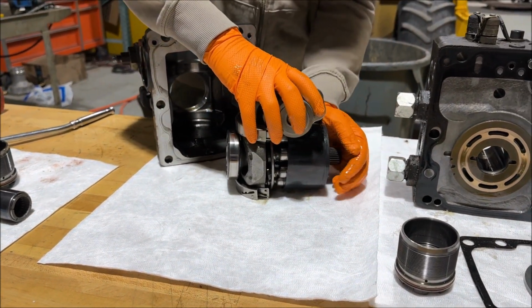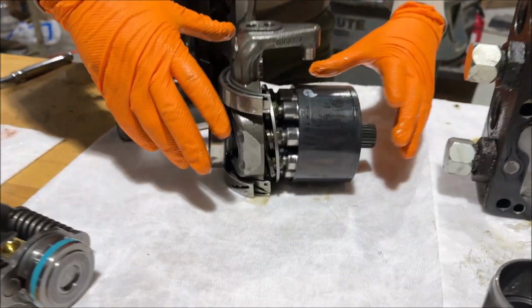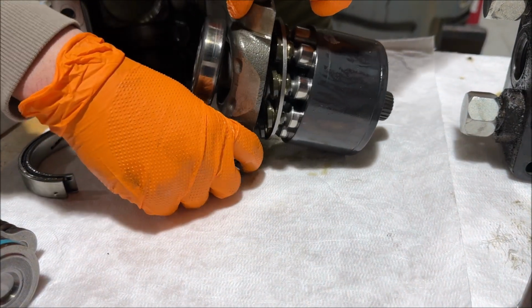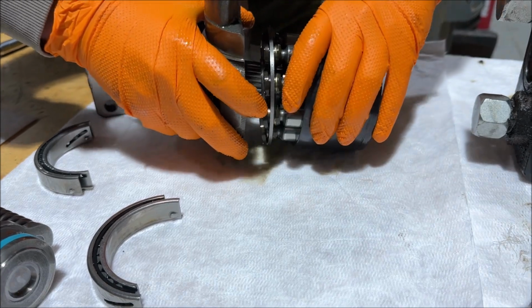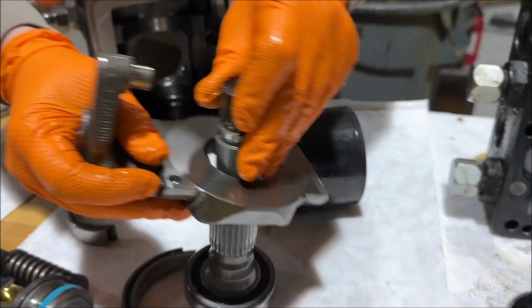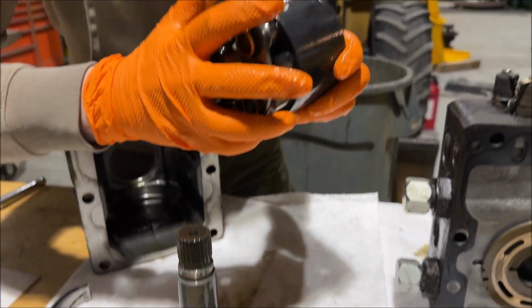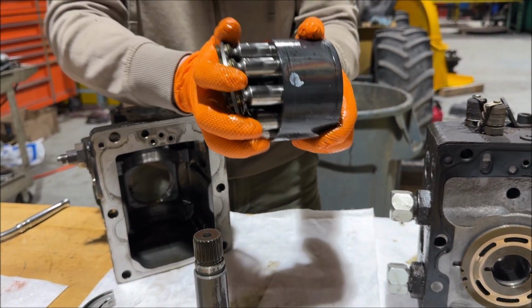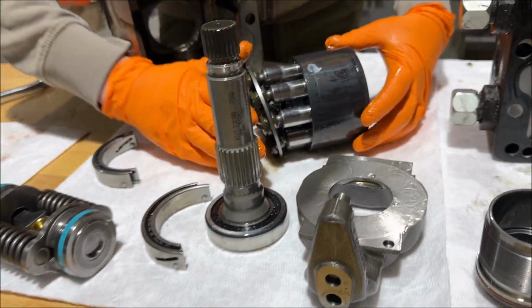Now, this is a really fun mechanism. This is a swash plate pump. And if you notice, it's got a whole bunch of pistons. Oh, you're really going to take it apart. Yeah. So don't lose anything. Okay. So you see those pistons? They're sliding out a little bit. Okay, they're what actually pumps the fluid through the system. Operates like that if this plate right here is doing the wobbly thing.